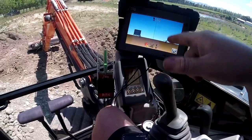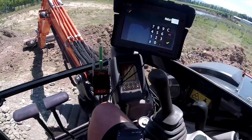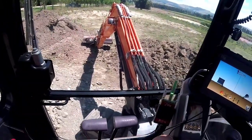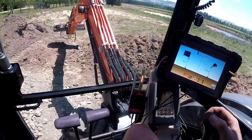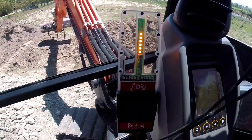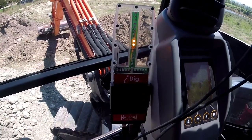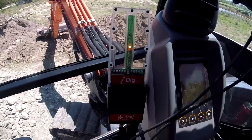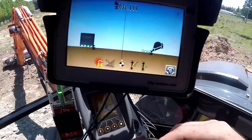Because we've just started the machine, it thinks that this is our zero. So I can set that as zero — the bucket's down there wherever I've touched the bucket — and that now becomes my point of reference. As I lift the bucket up you can see orange down here, and as we come down the lights go down: 100mm, 80mm, 70mm, 60mm, 50mm — and then boom, that is right on height.